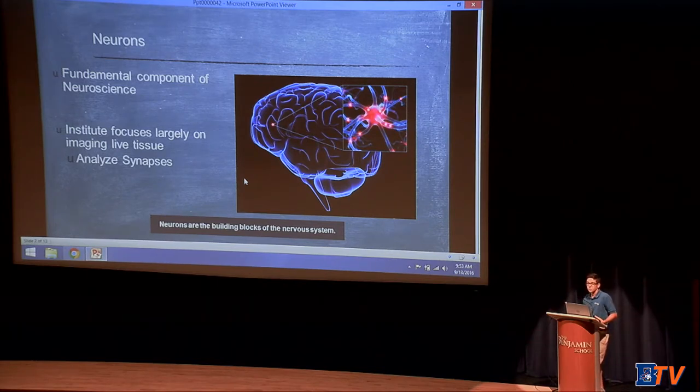I built a syringe pump, which is used to exchange different liquids in a cell culture sample. So when you're studying a neuron, you need to have it be alive underneath the microscope. You can't just take a slice of a brain and put it under a microscope and expect it to continue firing at the neuronal level without adding some liquids to represent a homeostatic environment like you have in the brain. So the goal of my project was to design a syringe pump to enable the perfusion of this media.